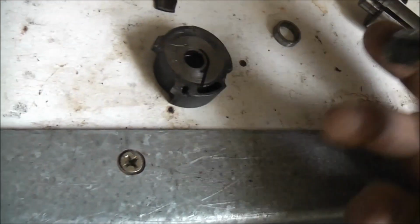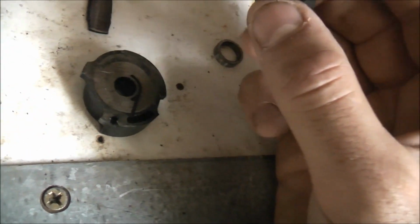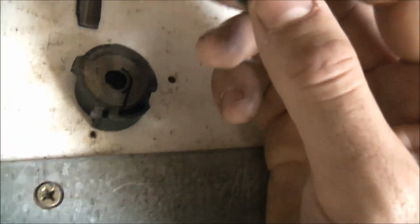It spins and you've got a top bearing. This actually isn't very easy to take apart either. These bearings are pressed on with Loctite. You've got a retention pin here, retention pin there, which I snapped off and broke to get this thing apart. I had to destroy it anyway, it was stuffed. Retention pins, and popped that off.